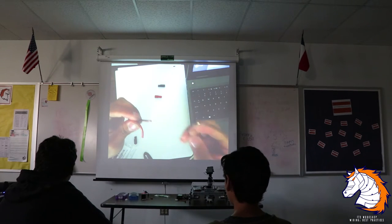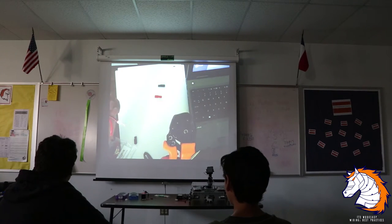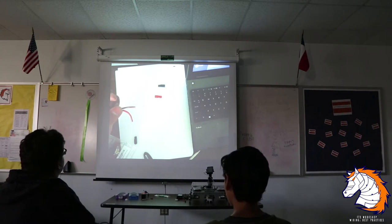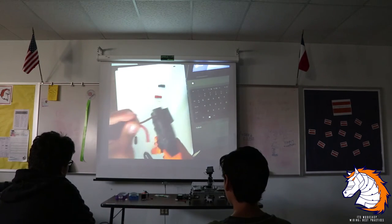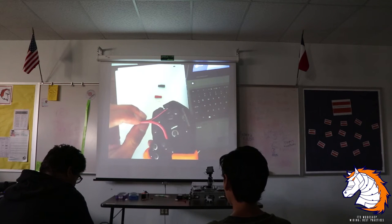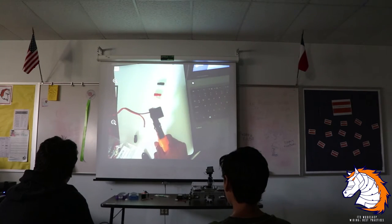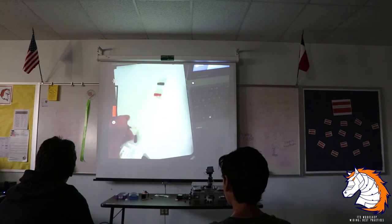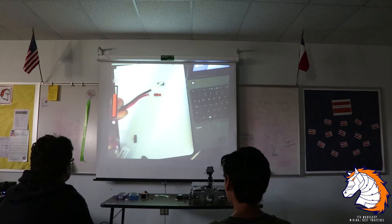After stripping, put the contact on the wire and then use the Anderson crimpers — you can find these on Amazon. There are different sizes in the crimper; you can see three holes. You just crimp it. After you crimp it, the result should be flat. A lot of students mess up because they put too much wire in there, which makes it harder.